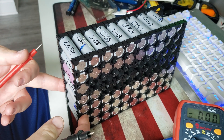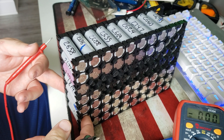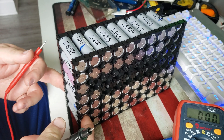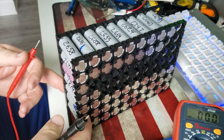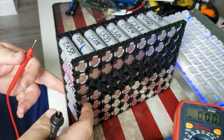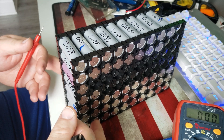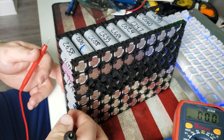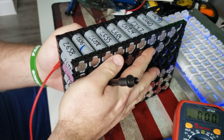These 2900 milliamp hour cells — if they were reading 18, well, that's half the capacity gone. But people say 'I'm not going to use anything over 2000.' Well, if this cell was at 2000, that's still 900 milliamp hours lower than rated, so it's been used a lot. I don't think it degrades faster the longer its life is. If it's down to 13 or 15, that's half capacity — it's been cycled thousands of times. I can see why you wouldn't want to mix that with brand new batteries.